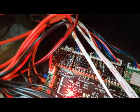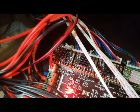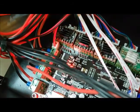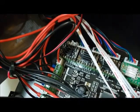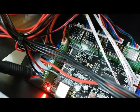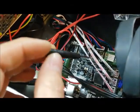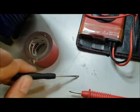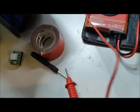I'm running about 1.2 volts on the Y. You can do this a couple of ways — get your ground in there, then take a small metal screwdriver to adjust with one hand. I will have the screwdriver in the pot like that, and with my other hand I'll be holding it on the metal blade of the screwdriver like that, which lets you read and adjust simultaneously.